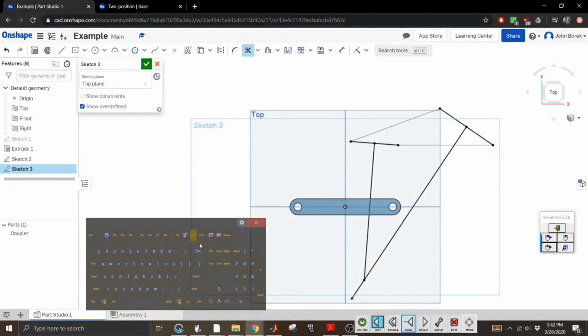Beautiful, look at that. We have now located our pole. All right, so now that we know where our pole is, because it's going to be along the assignment, we know that these two positions are going to be our moving pivots. So that makes our line of moving pivot the line that would connect the pole to these points, which means these perpendicular bisectors are now our line of fixed pivot.